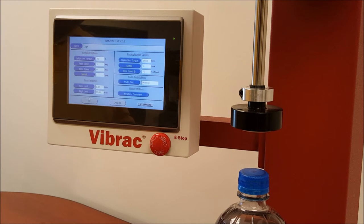Non-destructive testing is always done the way the machine is programmed: it will apply torque in the opening direction to the cap to the moment it starts to slip, which is breaking of the static friction. At that moment, the machine will stop and reapply the cap to whatever application torque we set it to. Extra travel is a great tool to measure what happens with the cap if you drive beyond the typical opening distance. But keep in mind: if you add extra travel and you're trying to do a non-destructive test, those two things don't work together. Adding extra travel will make it a destructive test, and it will no longer be non-destructive.